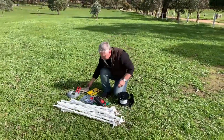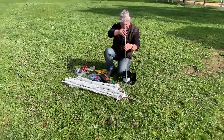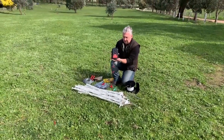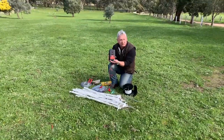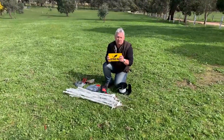Safety, of course — off the gloves. We have an earth rod for our battery energizer that we're going to fit. A little battery energizer, a 15k model, runs off 12 volts — ideal for this one. Remember to put a warning sign on everything.